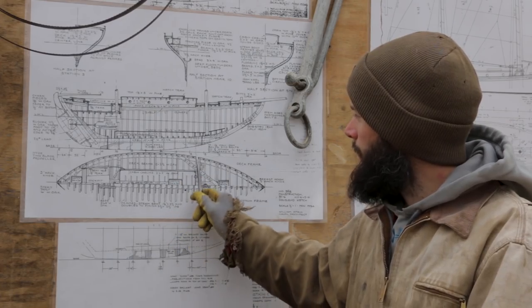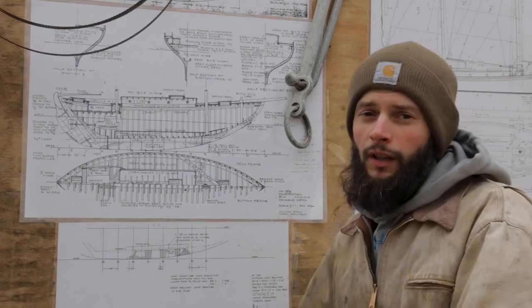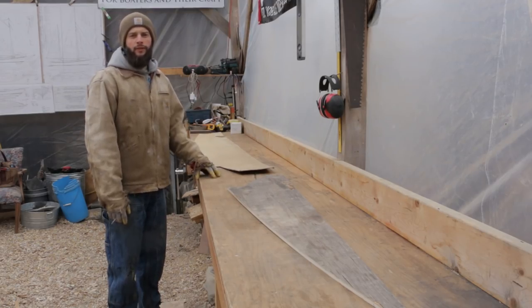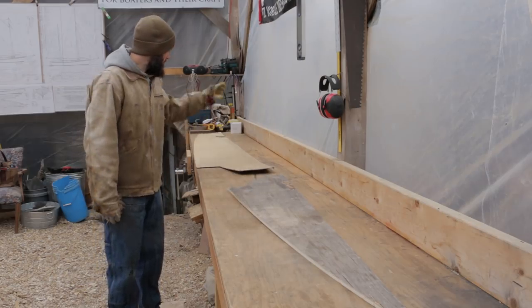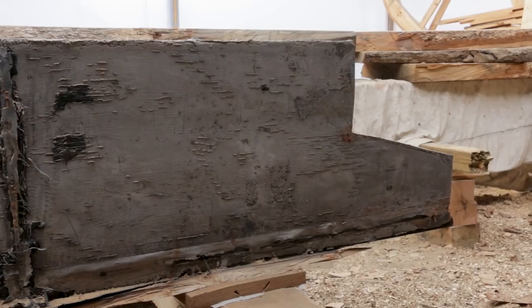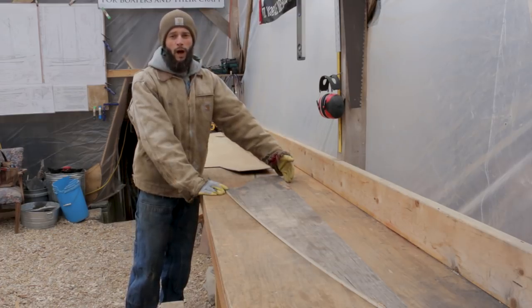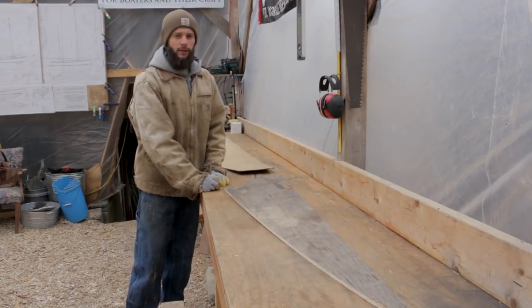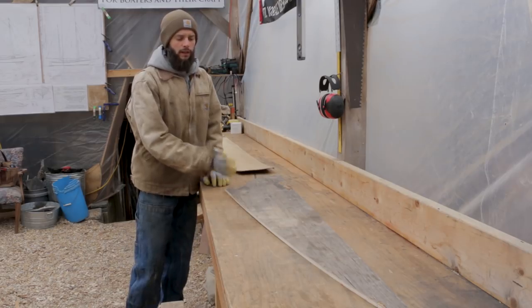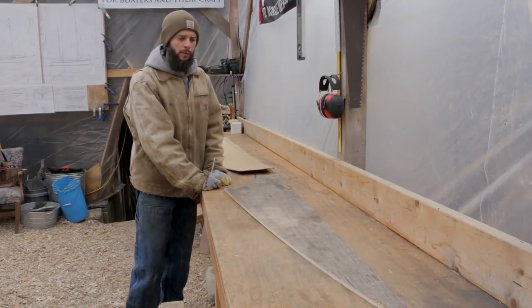We did that earlier and now have patterns for the deadwood fore and aft of the ballast keel. This is the pattern for fore of the ballast keel, and this is the pattern for aft of the ballast keel — the ballast keel will fit into these two jogs on either end. The top of this ends up being about a foot wide, tapering down to about six inches at the bottom edge. What we're going to do is laminate it out of some thinner, smaller pieces. Since this is the deadwood, it's more or less just fairing the boat in front of and aft of the ballast keel — it adds some strength but it's not a huge structural member.